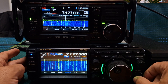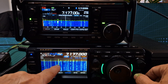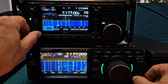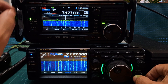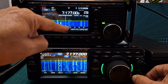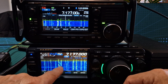So we just turn up the 710. You can see that we can tap the screen to change frequency, and we'll turn up the 705. They're not on the same antenna, but they're on similar antennas — they're both on long wires, but one's a 49-to-1 balun and one's 9-to-1, so it's not going to be exactly the same. Now what you'll notice on the ICOM is that you can change the colours within the waterfall, and they are linked to signal strength. With the 710, when you select this kind of colour, it's green and blue basically.